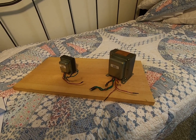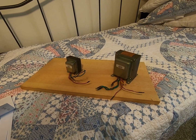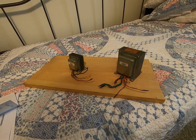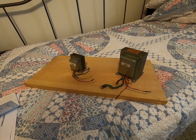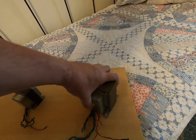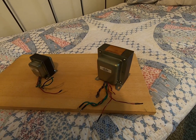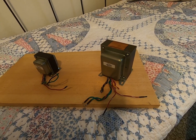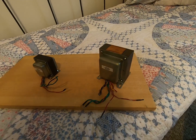So then I started looking. There was another board that was kind of messed up. The amp was fairly complex. It had power scaling, a 30 watt, half power or something like that, and had all kinds of cool stuff. Really great sounding amp. But whatever happened to kill this thing, this big old power transformer, the high voltage side of that thing is dead. I could probably still use it for the 5 volt and 6.3 volt heaters when I'm testing something, but this thing is gone.